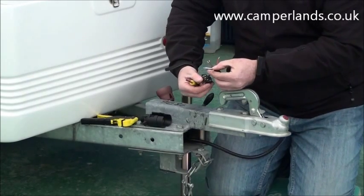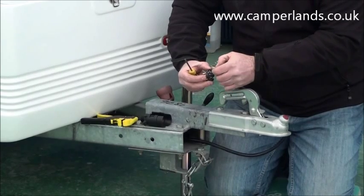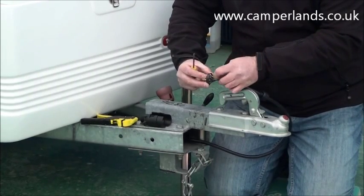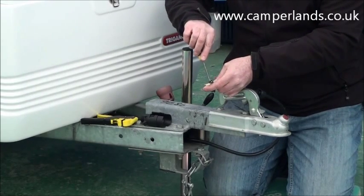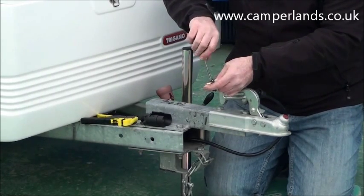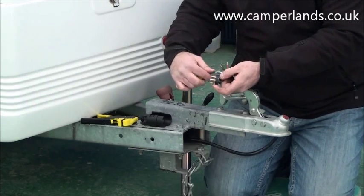The next one we're going to look for is the numbers. On here number one is yellow — you just rotate it round, find number one, and move the wires out of the way to let you get to number one. Push it in as far as it will go and tighten, and you just carry on in that sequence with number two, number three, number four.